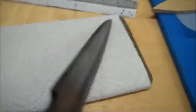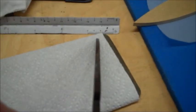The plate's cooled down. This is what it looks like after heat treatment. And it's got my primary grind on there, which has to be finished. This grind will go all the way up to the top, really a full flat grind for the chef's knife. But you have to leave a little bit of thickness in the edge so that you don't get any warping. And we're very straight, no warping. It was a good heat treat. So we'll go clean it up and see how it looks.